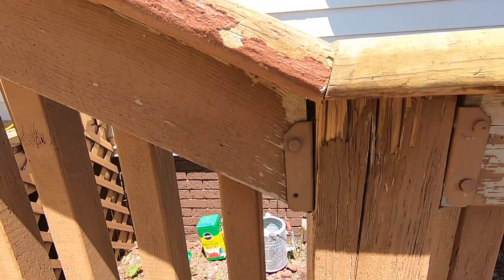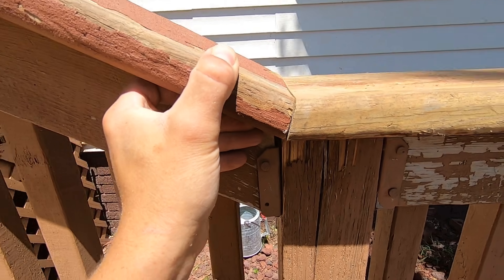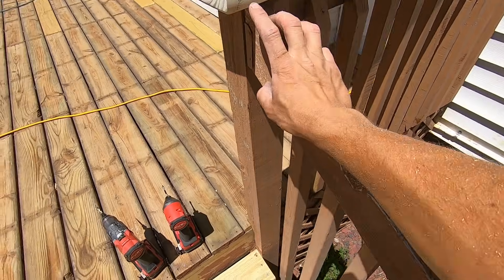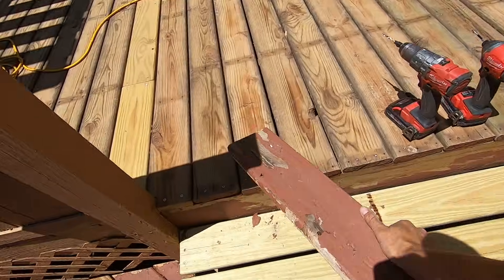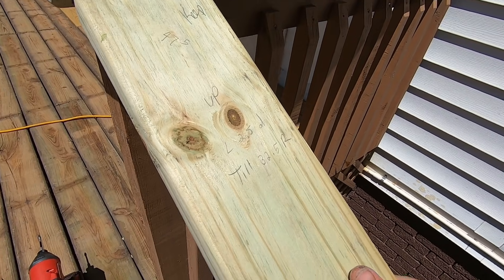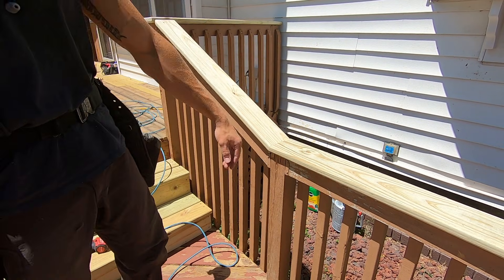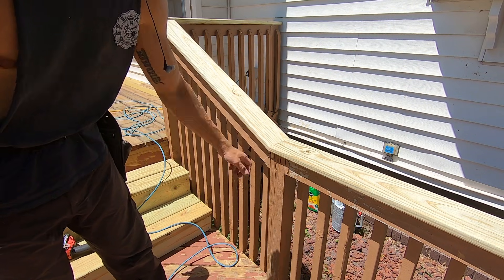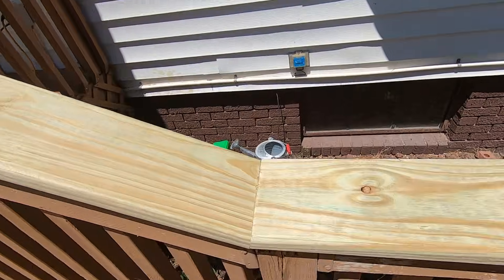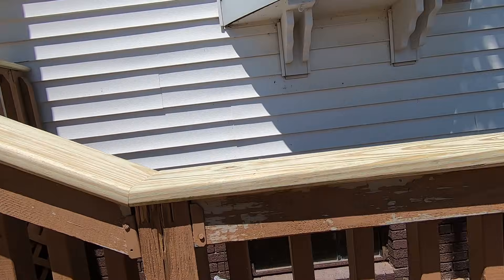What you can do is shim it up — I'm just tacking these on right now. I have to figure my long point up to here and the way I'm terminating up top is with a complementary angle. It's not perfect but it'll look nice from the top. I took my planer and planed it down to get this miter to turn out just right — sometimes you've got to do that. You can see it's a nice tight joint.